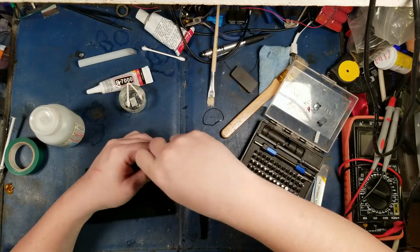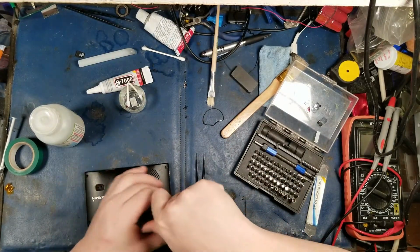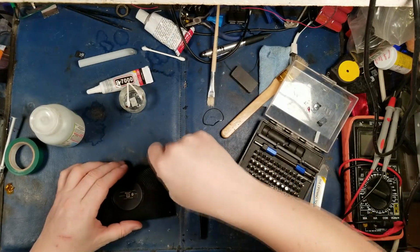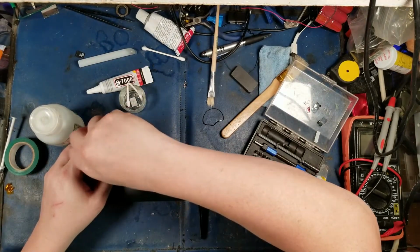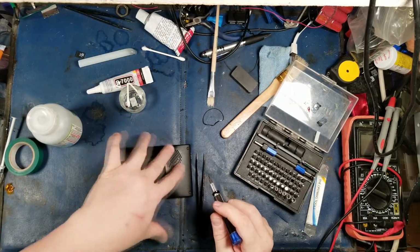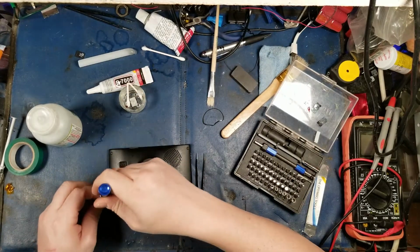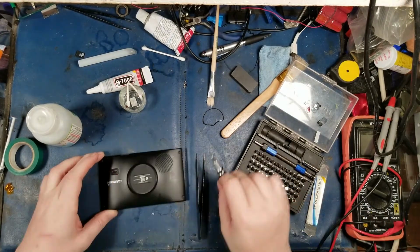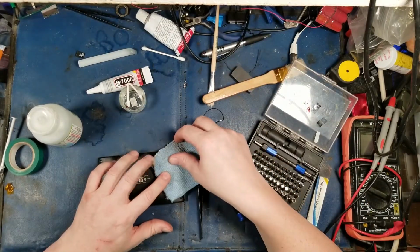And as you saw, I pulled a lot of iron filings out of this. The only way to really protect this thing from that type of contamination is to put silk screen over top of it, like a fine mesh. I don't have any right here right now, but I would put it inside and then put the speaker down into the speaker socket with that mesh over top of it, and that would keep the filings from getting stuck in it. But maybe in his case, it would make more sense to actually put a piece of mesh over top of it, something like this. That's all I can think of.